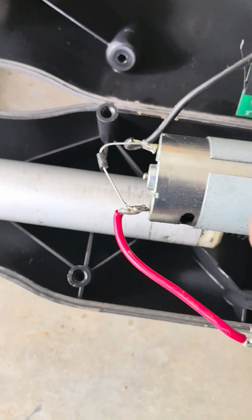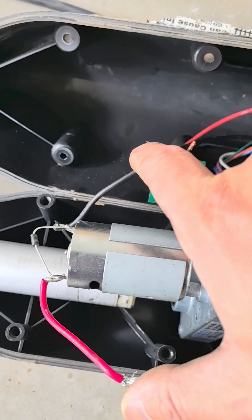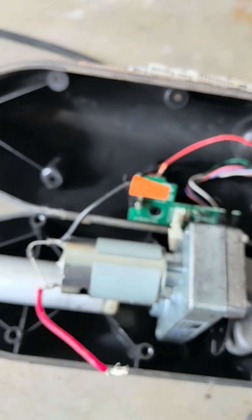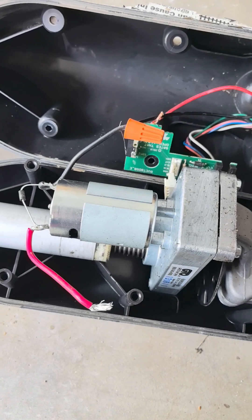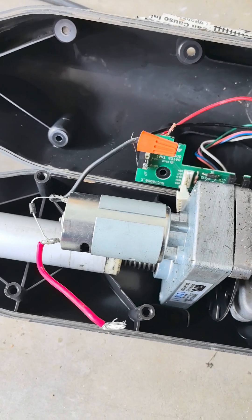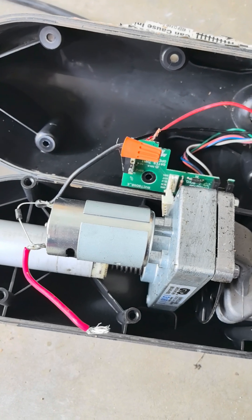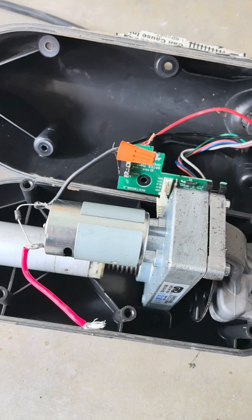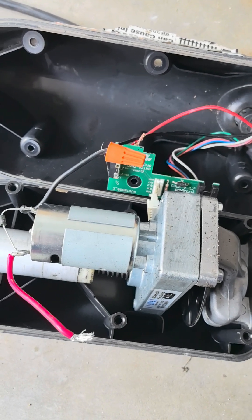I tested the motor. You can disconnect the motor from the wire nuts. It's a DC motor — if you apply 12 volts red to black or black to red, you'll extend the arm. If you apply red to red and black to black with 12V DC, the arm will retract. I tested the motor and it was fine. If you want to change the motor, it's not that difficult. There's a gear on the motor shaft — you can buy a $10 tool to remove the gear off the shaft instead of the heating method recommended on YouTube.